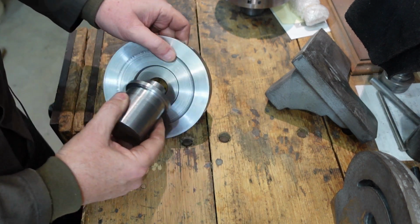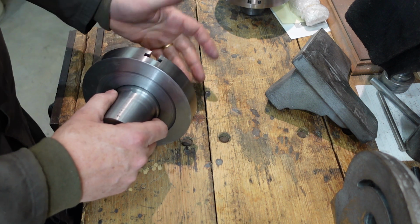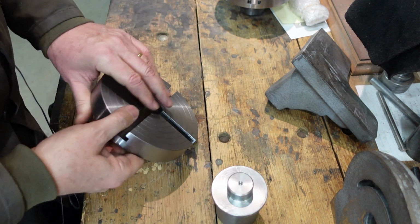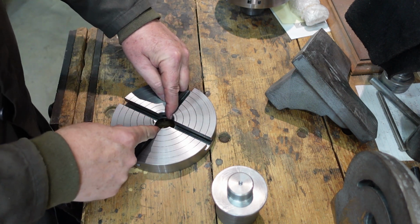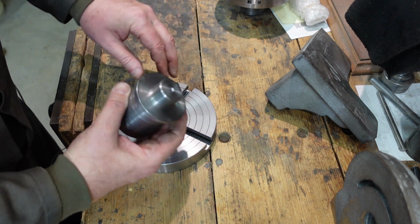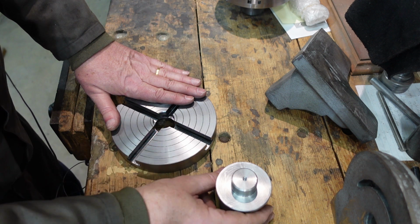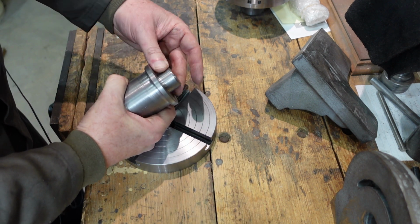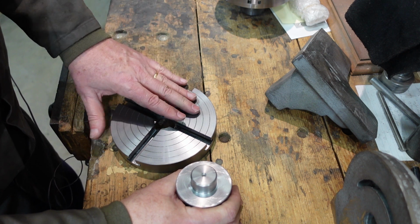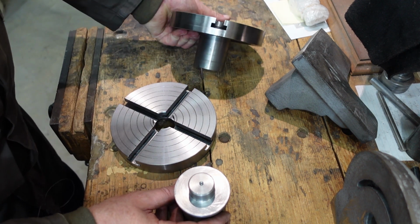I've machined up a stub shaft, and I'm now going to push that in, and the interference is going to be on the large diameter, and then just run around with the welder here, and also on these little pieces here. Something important to note, I guess, is that because I've already got this relieved out, if I go for an interference fit on this diameter here, which is the attractive one because it's the longer one, I could end up splaying this table out. So instead I've had to go for the interference fit. It's only a couple of thou on the larger diameter. This is basically a size for size fit in here. I'll push that in, a couple of tacks up here just to hold everything, weld around the base, then come back and finish up the top, and that should give me basically that same assembly.